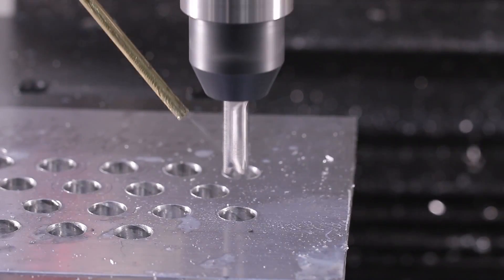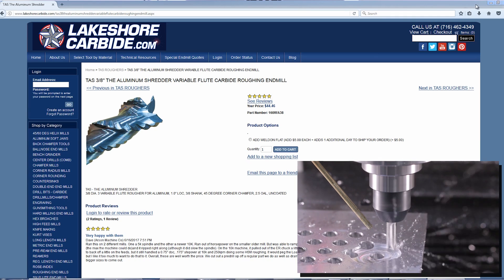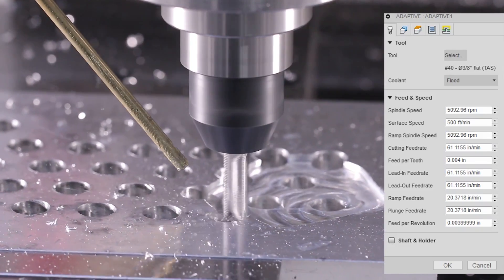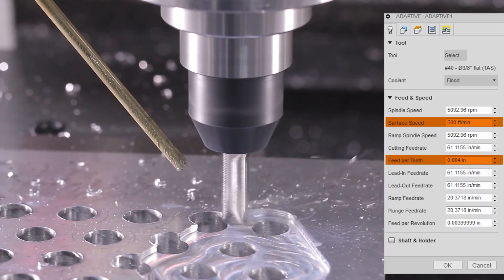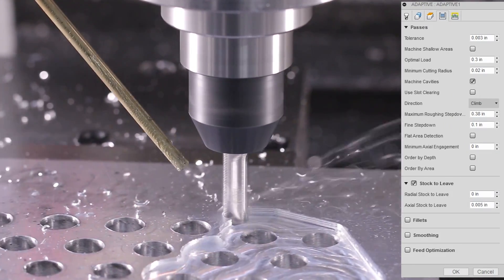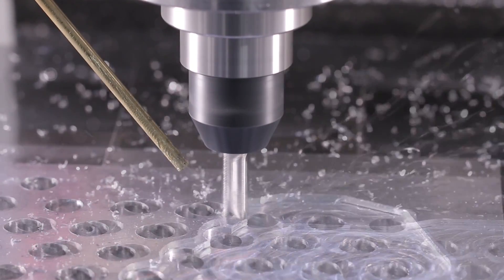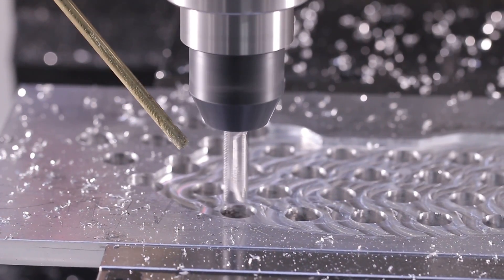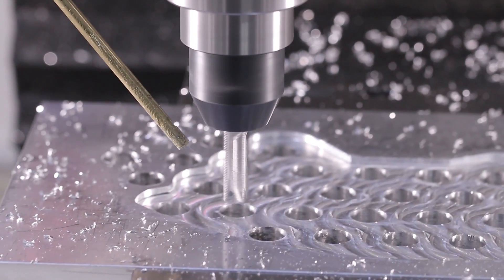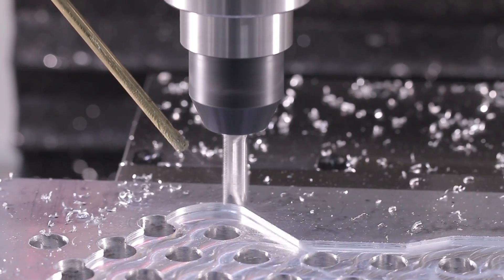So now we've got a pocket out of the top of this. We are using a three-eighth inch TAS tool from Lakeshore Carbide as a roughing tool — the corn cob geometry helps reduce your tool pressure and does a really good job of making really small chips. We're doing a very unusual strategy: 500 surface feet per minute, that's just about at the max RPM, four thou per tooth, or about 61 inches per minute. Normally with adaptive toolpaths in Fusion I'm cutting very thin width of cut and a deeper depth of cut — well right here I'm only cutting 0.12 inches deep, so we're going to take a wider width of cut, 0.3 inches. I spent some time tweaking these settings to get the cycle time down on this decking pocket operation — two minutes, I think is pretty darn good. I started out at seven or eight minutes. It's a reliable process: good chip evacuation, the machine sounds good, no chatter.